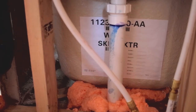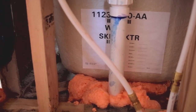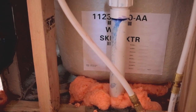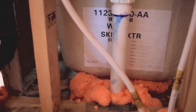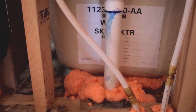What we're looking at now is where the drain for the bathtub penetrates the floor — the drain and the overflow valve — and that has to be sealed. Usually the plumbers cut out a pretty good chunk of the flooring, so you have to patch it in and then seal around it. Right in front of that you'll see the two water lines for the bathtub going down through the wall plate, and those have been sealed also.